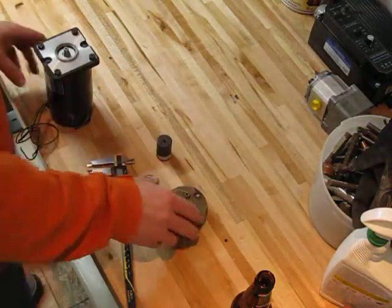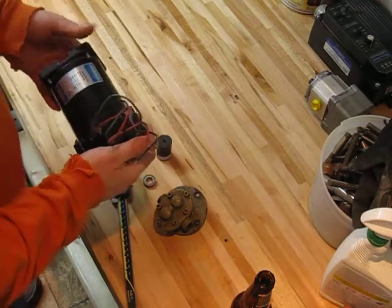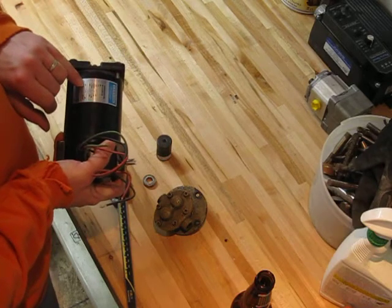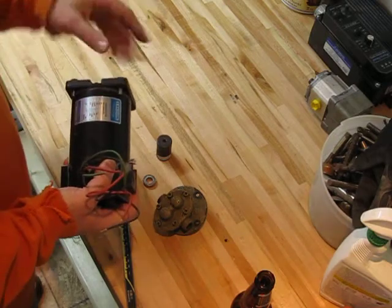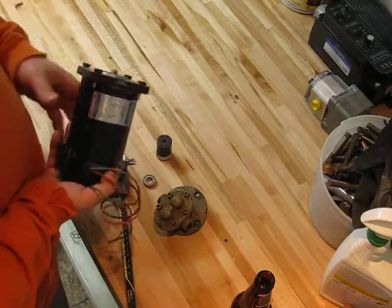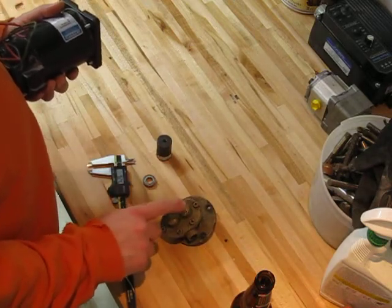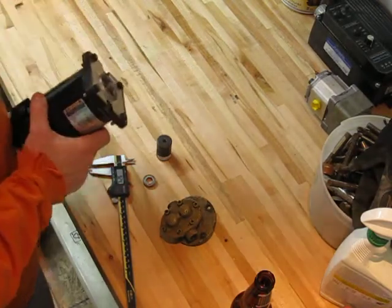Here's my pump and my motor. This bad boy is a DC motor. It's a Leeson. It's 1.5 amps, 90 volts, and now the foggy part is, it says 42 RPM, but this actually attaches to a gearbox, and the output of that gearbox is 42 RPM. Obviously I don't have the rest of that, and I have no interest in it. For nameplate, this needs to run at about 1100 RPM, and I don't know what kind of output it does at that volume, but that's what it's supposed to run at. This will do that speed without the extra gearbox.